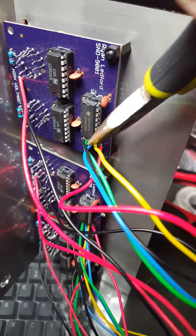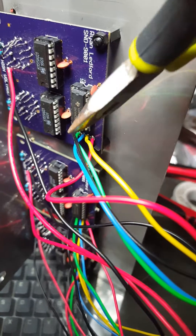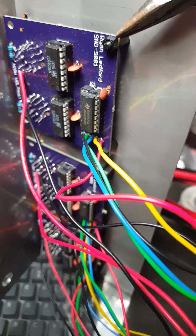Looking at the inside of the clock carefully — this is just a quick prototype I've pushed together. Here's the back of those chips. You can see over here I've got my high voltage off each chip, with the red and black wire coming down into either side of my prototype. Then I've got my data wires — the yellow, blue, and green ones — and then a red and black one for my 5-volt logic. You can see where I've got standoffs holding them up, and I've got three different sets of circuitry coming into the housing.